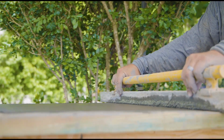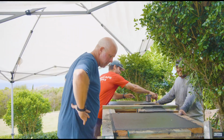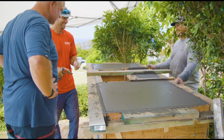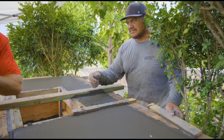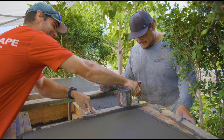Here's another shot, just going over it again, just rechecking again and again, making sure it's flat. Now we're taking off even more cleats. This is as time goes on, concrete's getting harder. We're able to pull off these braces, add some material into the holes that we had under those cleats, and recheck it with the level again.